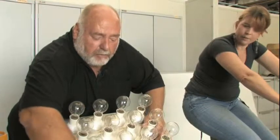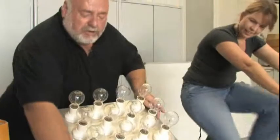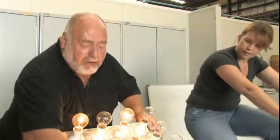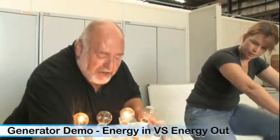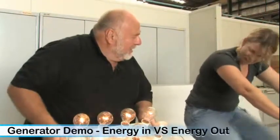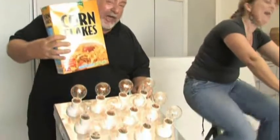If you'd like, I'll take it off again and put one or two lights on — easy, easy. But as we increase the load with electricity, we get two things: we get heat and we get current flow. With current flow we get magnetism, and as I increase the load, more current runs through creating more magnetism, opposing the magnets in that generator — actually opposing it and trying to make it harder. That's doing a great job for Laura because now it's really, really hard. Keep going Laura! And thanks to cornflakes and thanks to Laura, we're producing electricity the hard way.